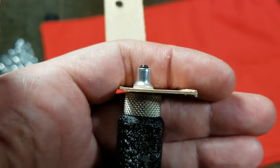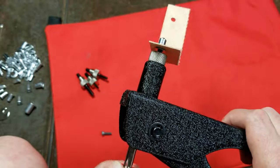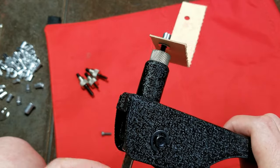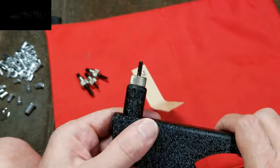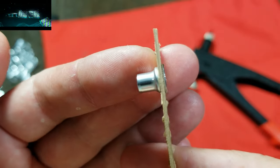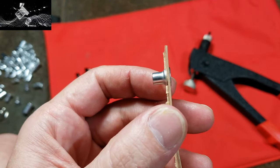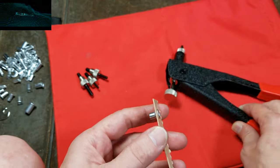We can see how well it mushed it out. Then we release it, put a little bit more pressure on the handle because otherwise it binds, and then we just unscrew it. That's part of the design — the threads are made so that it pulls directly on the threads to make sure the threads in the actual nutsert don't get messed up, so it works smoothly when you're finished. If it isn't tight enough, you can always just thread the tool in and give it another squeeze.